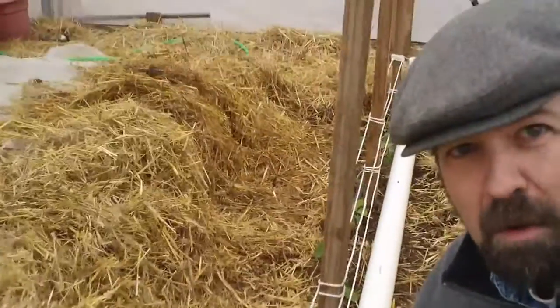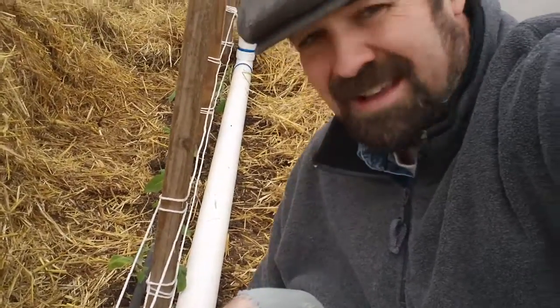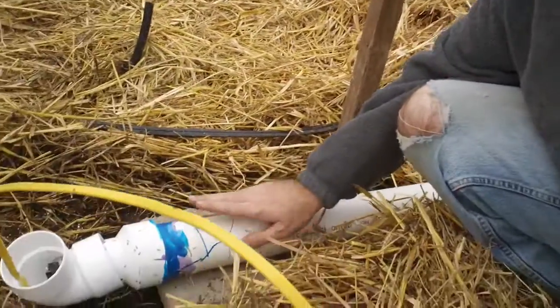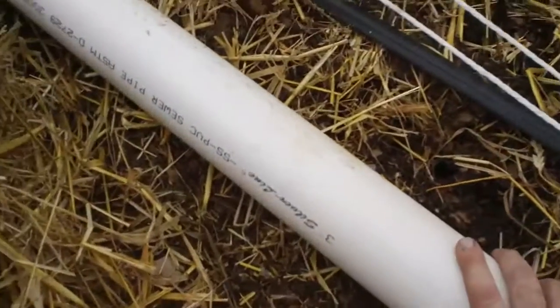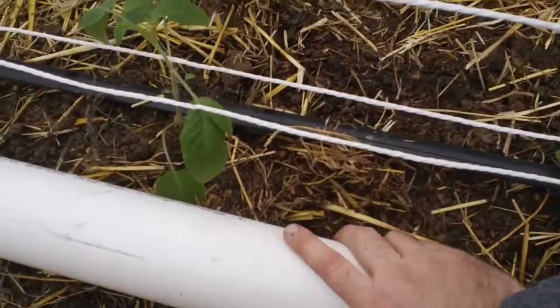Up here at the top end, I'm almost to the top. The pipe feels just as cold as it would with 55-degree water in it. I don't have any temperature sensors right now — I'll try to get some, but for now I'm just going to go by feel. Cool pipe up here at the top. Right on top of the element, I can feel that it's warm. Here at the first junction — this pipe I cut a little short, so it's probably only about 8 or 9 feet long. Eight feet away, I can feel warmth, and this has been on for maybe 5 minutes. At the halfway point it is just barely above the coolness underneath.